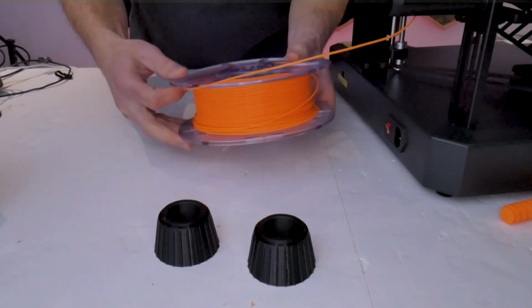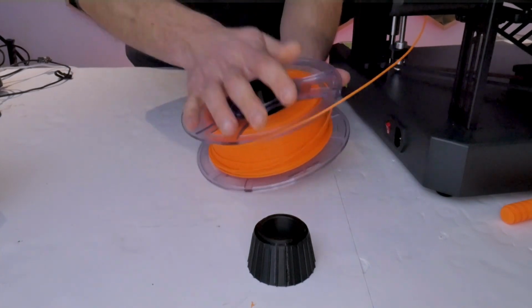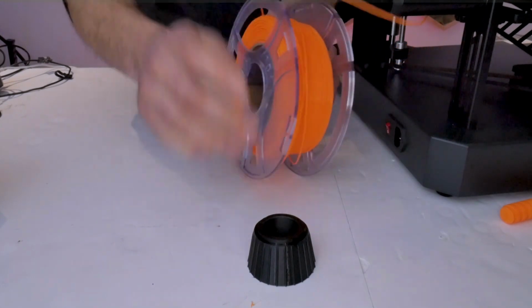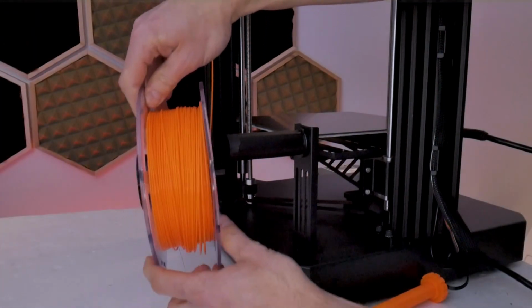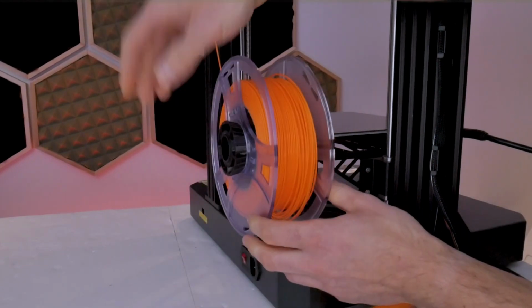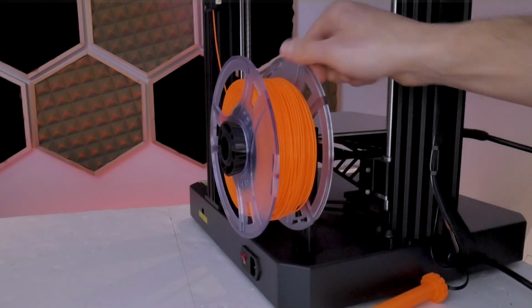Now you can take the conical grippers and press them into the inner diameter of your spool, and because they are cone shaped, they should be more or less self-centering, and because they're made out of TPU, they should grip the center of the spool and hold on pretty snug. And now because you ground the flange off of the original Creality tube, this should slip right over the tube and now roll nicely on the original spool holder tube.